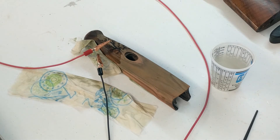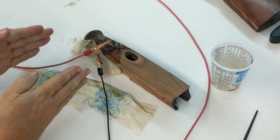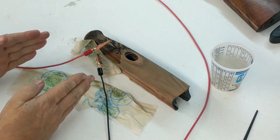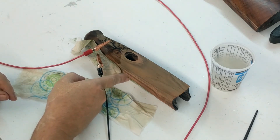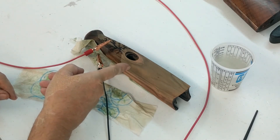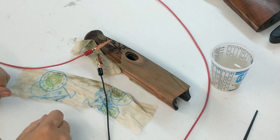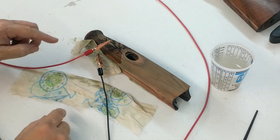Okay, now if you'll notice — we've turned the forend around to finish up the other half of the front half. You'll notice some staining: that's the original color of the wood, and that's the color after the baking soda and water is applied. That staining just occurs — there's nothing we can do to avoid it. However, we can use some oxalic acid and bleach it back to its normal color once we finish the pattern completely and before we start finishing the wood.